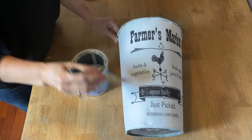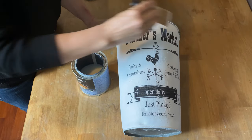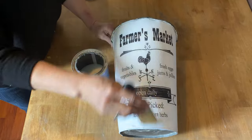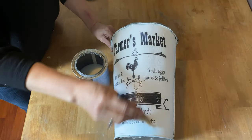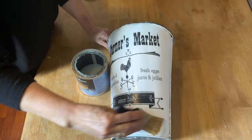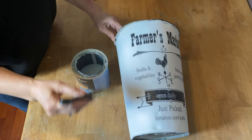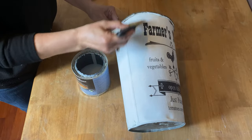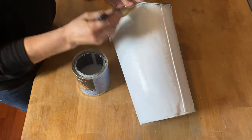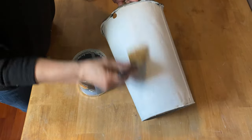I've let it dry completely and now I'm going to put a top coat. Because this is probably going to be outside on my covered deck or porch, I'm going to use my Varathane outdoor polyacrylic sealer in a matte finish. I like using the outdoor formula because it's a lot more durable than the indoor version, especially if your project is going to be outside. I'm going to put a good coat over the whole project and then set it aside to dry.